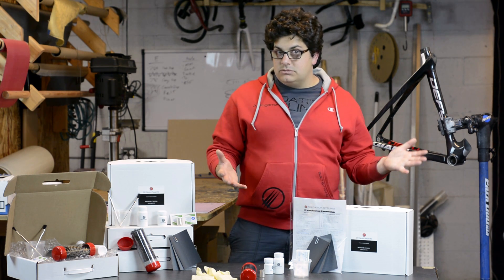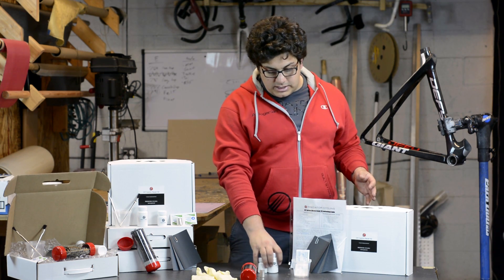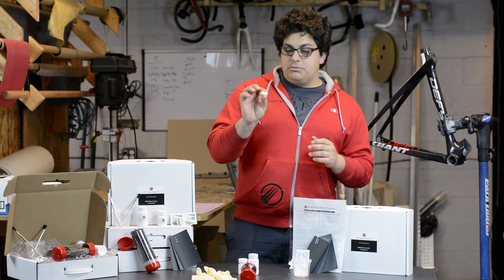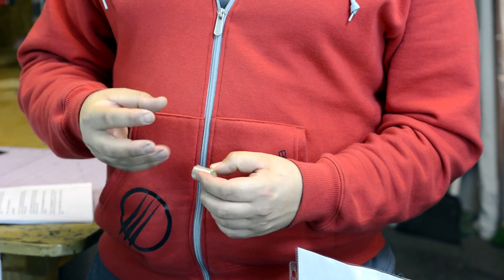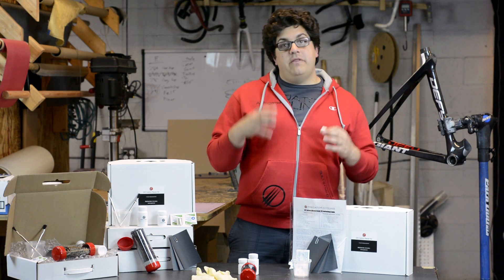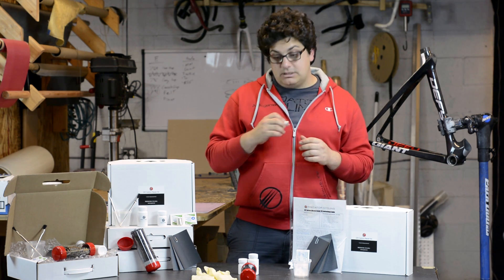So it's not safe. Always use UV stable epoxies — we supply you with a very high quality epoxy right here. We also give you two yards of compression tape. This is used to apply over the repair area itself, and heat compresses it, giving you uniform compression throughout the repair. That will help get the excess epoxy out and make sure that you have a solid bond to the substrate.